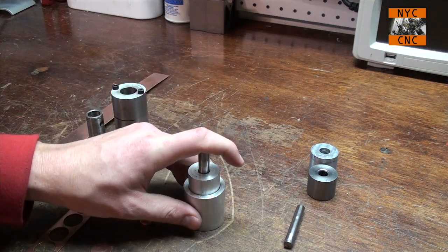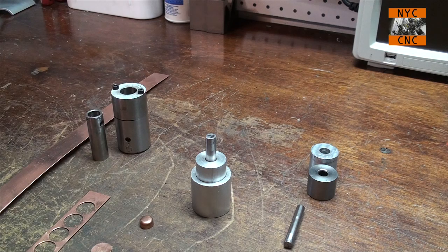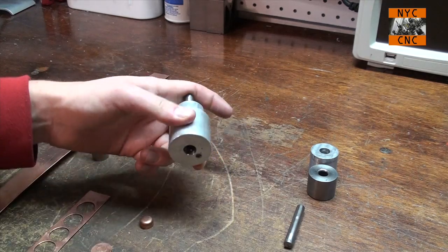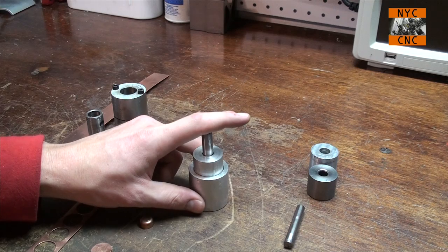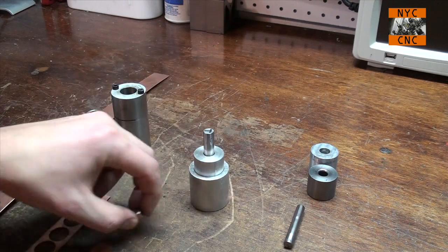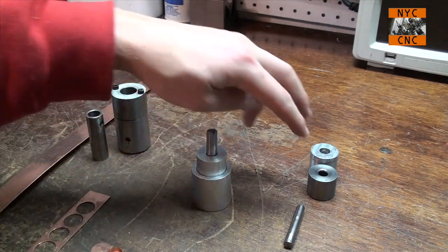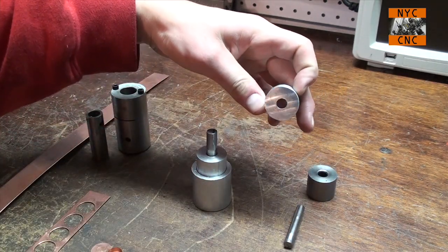The other exciting piece of news is I was playing around with this and had been running it in my 12-ton shop press, and I went ahead and tried it in my small one-ton arbor press — and sure enough, it works. I'm probably at the sort of limit of the arbor press's oomph, but it does work, and that's really convenient and has got me thinking about next stages and designs. So we'll go to our arbor press, draw out these two cups through this die, and then switch over and draw them out in the final die as well.